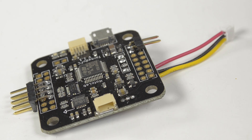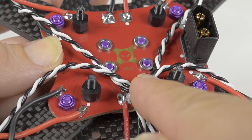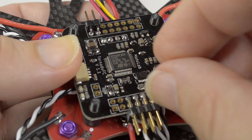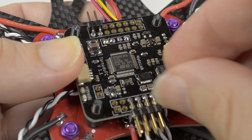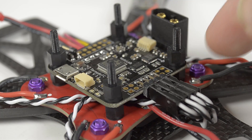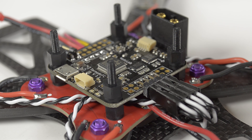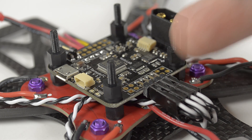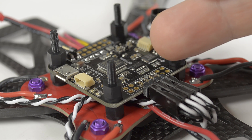Take your flight controller. Here we have a Tornado with the signal wires routed as shown. Mount the flight controller and install the remaining standoffs. At this time check the polarity of all your ESCs before plugging them into a current-limited source like AA batteries, programming the ESCs and then connecting them to the flight controller.